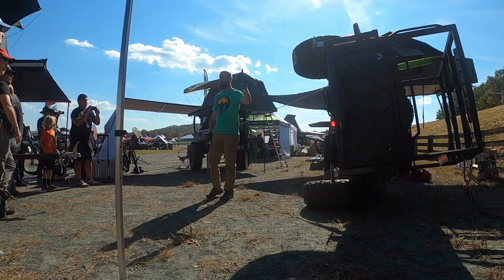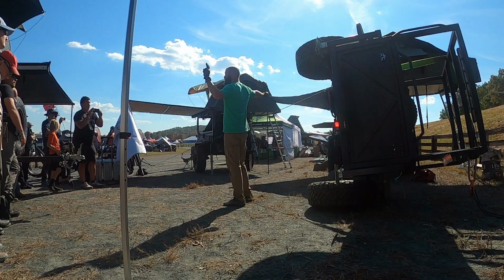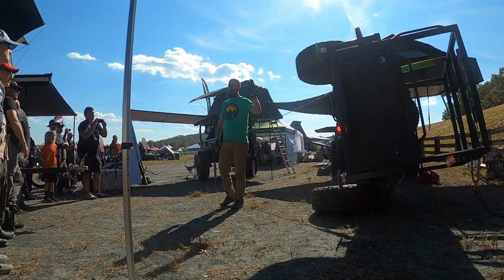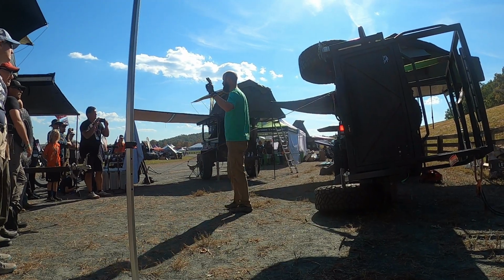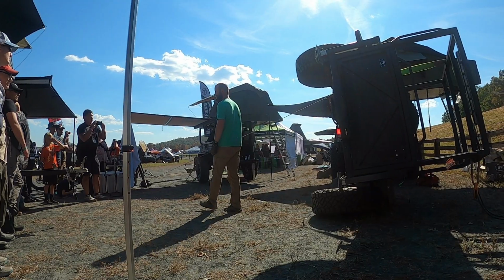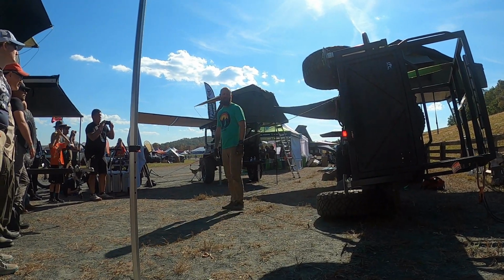I rely on 3 P's of recovery. Proper plan, I planned it out. Proper rigging, right? I rigged everything correctly. And proper gear, all my gear is rated appropriately. If I do have all 3 of those things, safety is a byproduct of that, right? Safety is a byproduct of that.